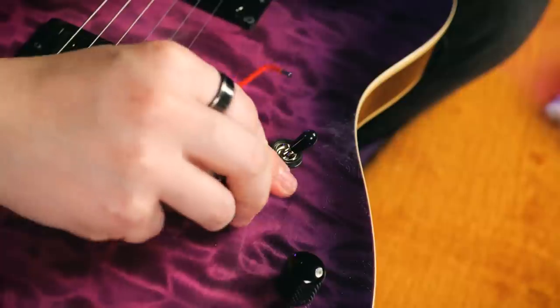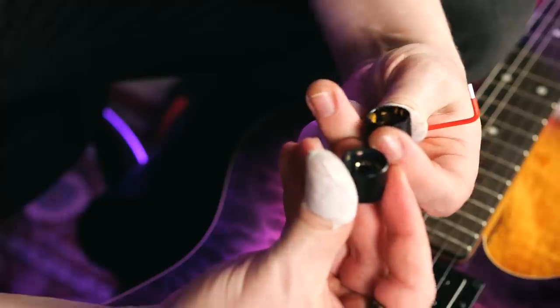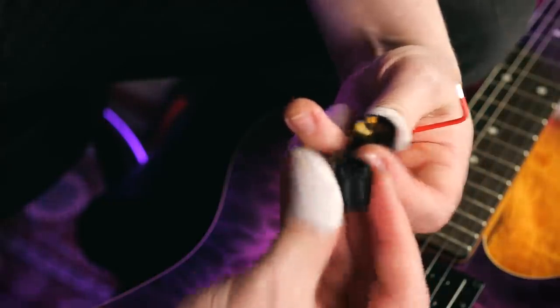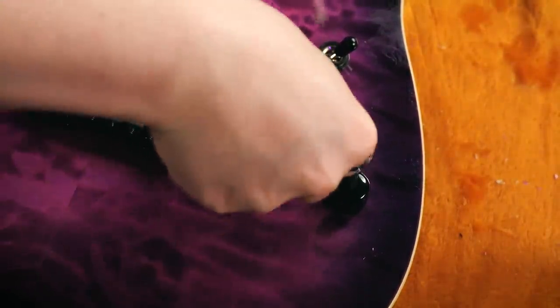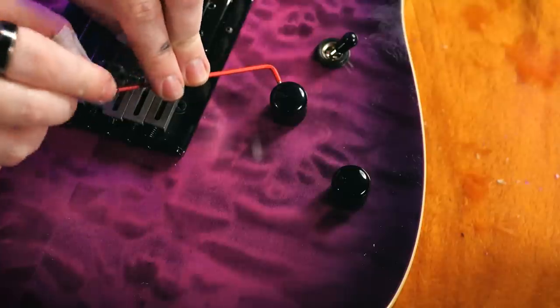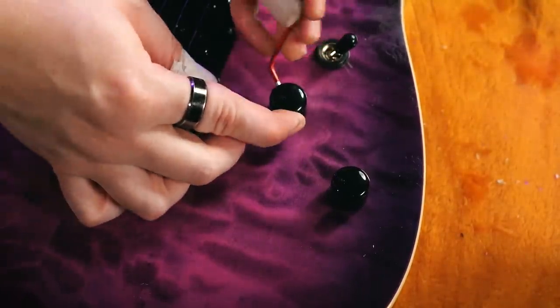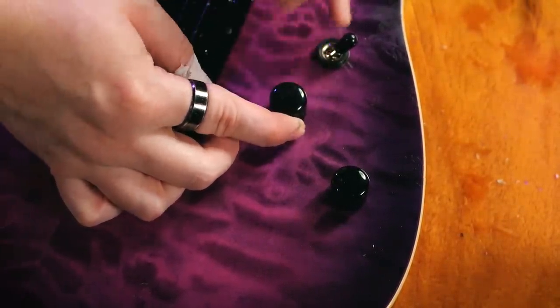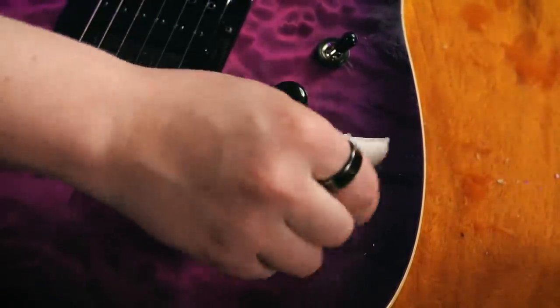Oh yeah, that knob had a hole fitted for the splines on the Korean pot shaft, which are a completely different pitch and diameter to the CTS pot that I've installed. So I had to drill out the center hole to 6mm round and let the little grub screw hold the pot to the new shaft. If you're using a split post knurled shaft, then always align the grub screw to the slot of the shaft, as this will prevent the split shaft collapsing inside the knob.